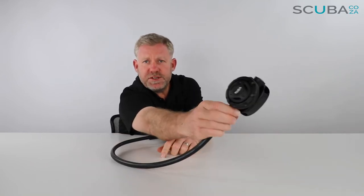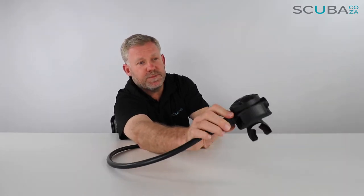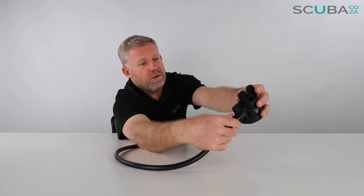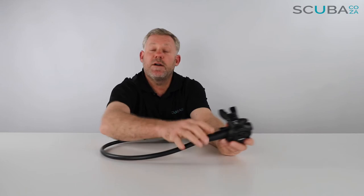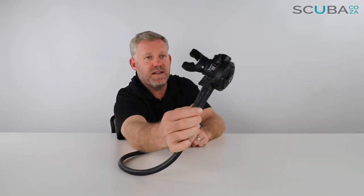The front purge valve — only the middle section is purgeable. It's got a nice big chunky frame around the outside which will go a long way to protect the regulator and look after the purge button. The smaller purge also reduces the chance of the regulator free-flowing. The whole second stage is made of a molded polymer so it's quite solid. TUSA regulators are renowned for being really hard workhorses and never giving any problems. The T-piece is relatively big so it'll deflect the bubbles away from your chin really well, and it's got TUSA's ergonomic comfortable bite mouthpiece.